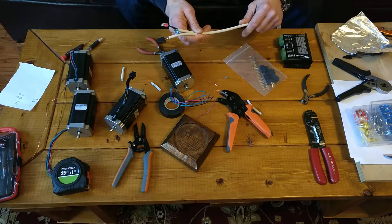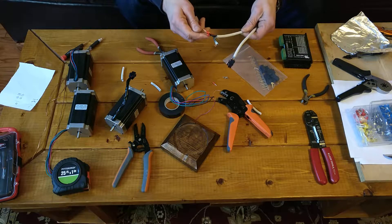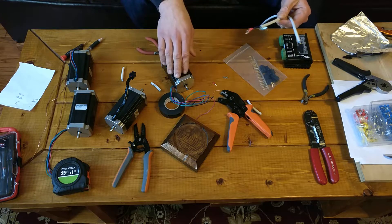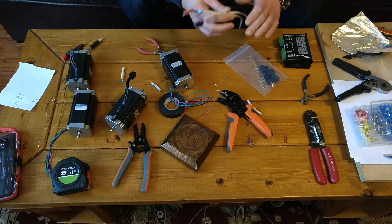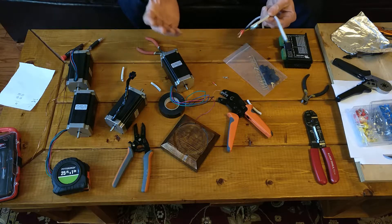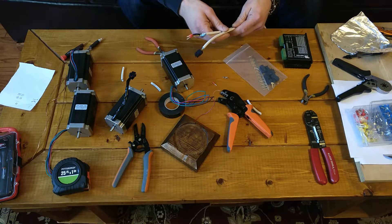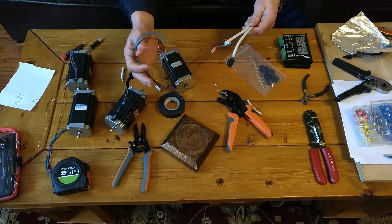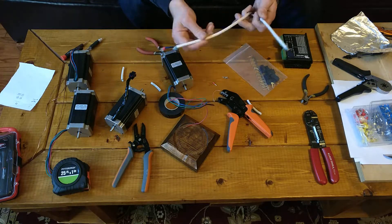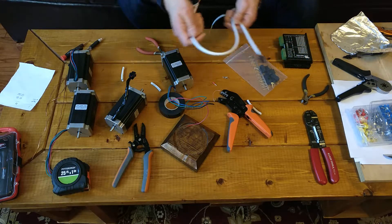This is the twisted pair shielded cable that I showed in one of the earlier videos. The shielding we'll talk about later, but the important thing for now is that it has four conductors that I'm using for power transfer between the drivers and the steppers. They're 18 gauge, which should be more than enough for the 3 amps these guys draw, and shouldn't show any significant voltage drop. I picked this size mostly because it's a nice size — like the pigtails on here are 22 gauge, which just seems a little bit fragile to me, whereas this is quite a bit more robust.